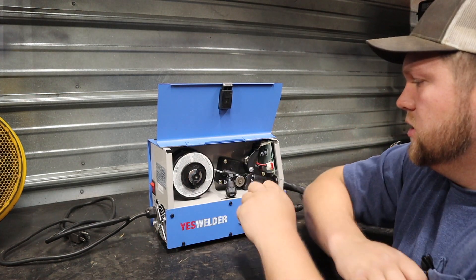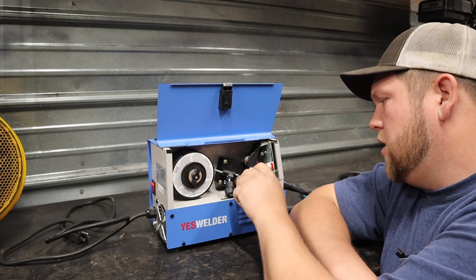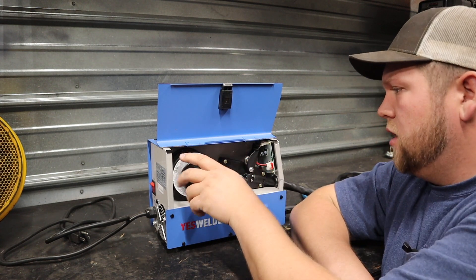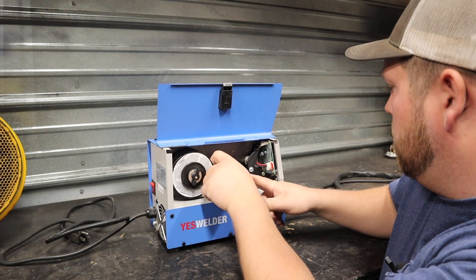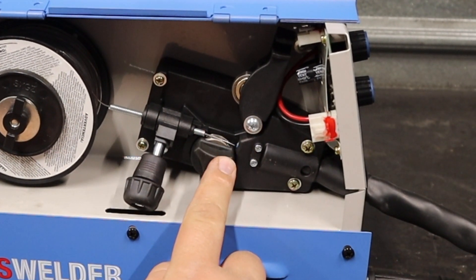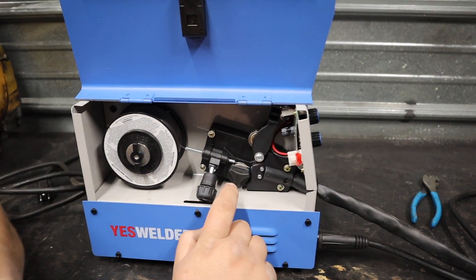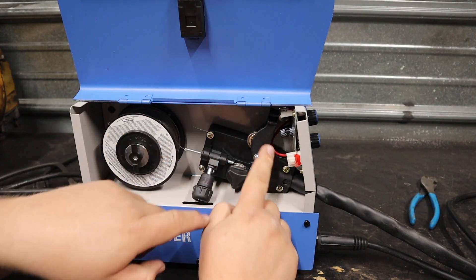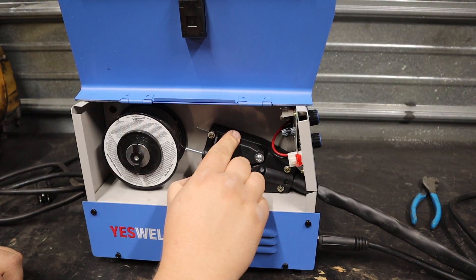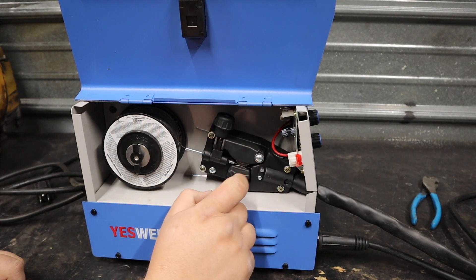You're going to want to put your cap on, because especially on this style, if you don't put the cap on now, you're not going to get it on later and you're going to have to totally redo it — pull the wire back out and then put the cap on. So I'm going to push this wire through a little bit more to where it's almost running through the liner out to my gun. I can see the liner to the MIG gun just poking out here a little bit. Before you close the other wheel on top, you're going to want to feed the wire into that liner. I think I've just barely got it inside. I want to get this wire pulled through.